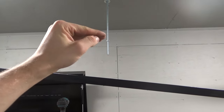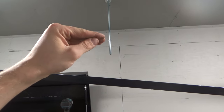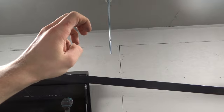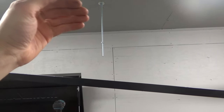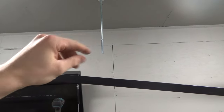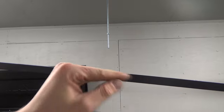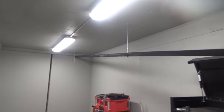So there's a keeper nut on top, lock washer, just for some preload. It's not necessarily required; some people would say you should have it on both sides, some say on neither, but in this case we're just on one side, which is the top. Then we're gonna go regular washer, steel L, one washer below, nut. That's it. Pretty simple, eh?